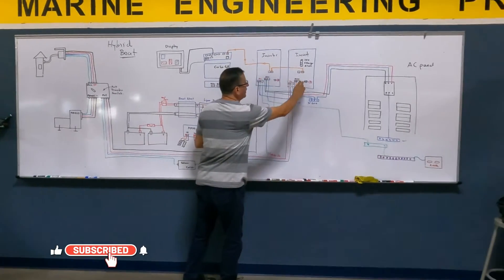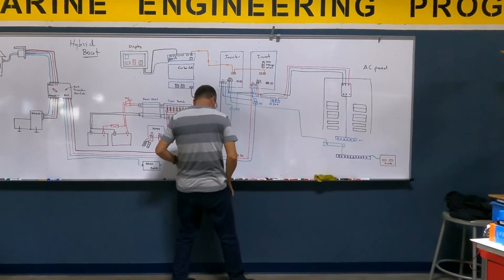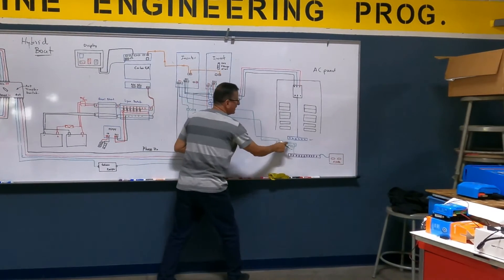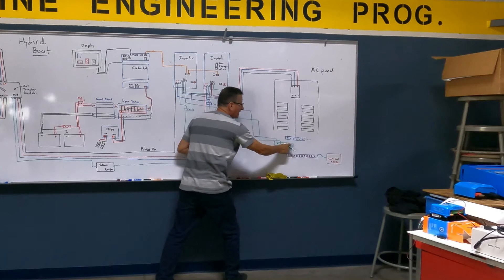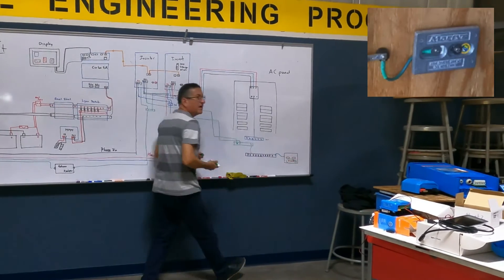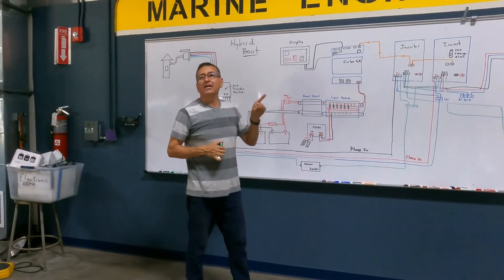In the output of each inverter, I produce another ground. That ground bus bar will be the ground of the AC panel, connected with the bonding conductor, and the bonding conductor will be connected with the sacrificial anode. This is the procedure to connect split phase.